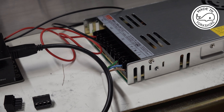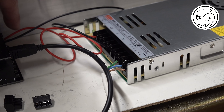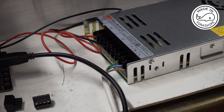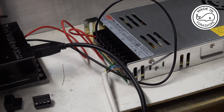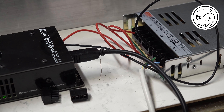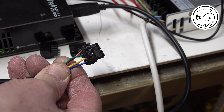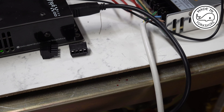Well, the good news is the power supply has arrived. So it's just a matter of connecting it to the mains and then taking a positive from this rail into the BlackBox and a negative from this rail into the BlackBox, just making sure that I've got the polarity right. I've previously switched that on and the software on the PC did actually recognise it was attached. The connections for the motor go A+, A−, B+, B−, and from what I can gather those colour codes are right. So it's just a matter of plugging this into the BlackBox.